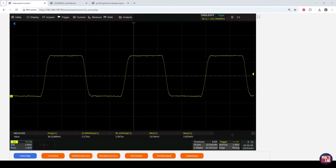With R64 at 50 ohms, this waveform looks pretty great. We have a fairly clean square wave with rounded edges, not really getting any overshoot or undershoot, and no visible ringing to speak of. Rise and fall times are around 2 to 2.2 nanoseconds, and max/min amplitudes are well within what we would want. So a 50 ohm series termination resistor looks very good.